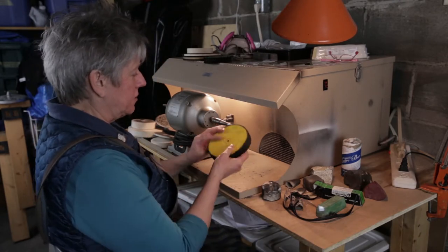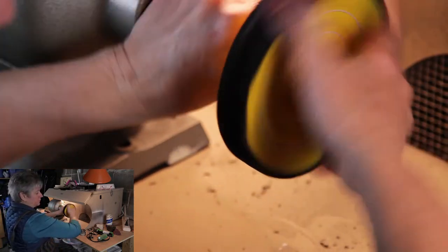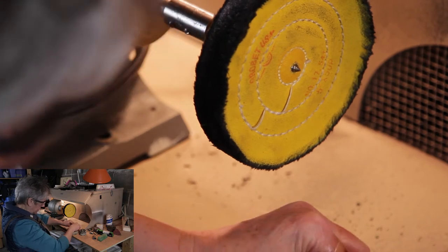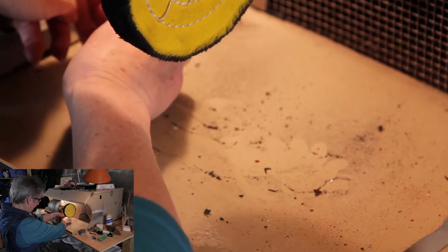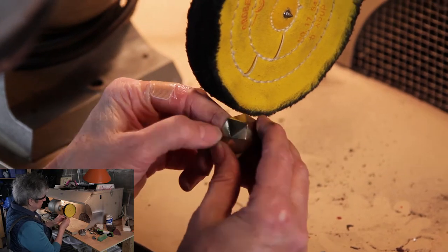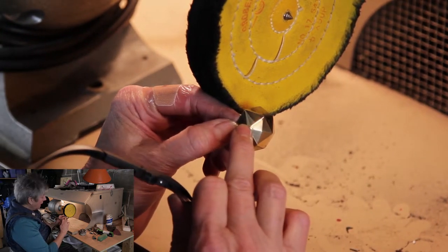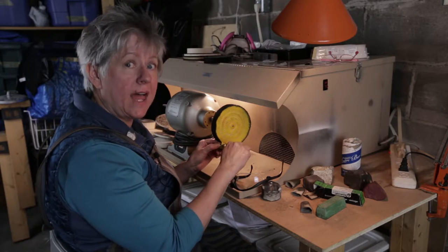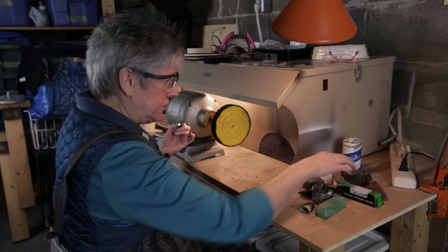Here we are. I've got a nice little shelf under my polishing bench. This is one of the treated ones and it's very firm, so that's a good choice. I sanded it so flat that I can't pick it up. Now, which face was it that I was working on? As I look at this face, I can see that I'm getting tiny little drag marks from the coarser lines of the lap — the luster bar wasn't cutting through them, it was just dragging them out. And that's why I've gone back to Tripoli.